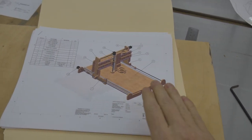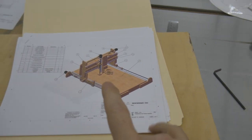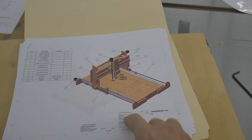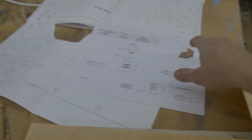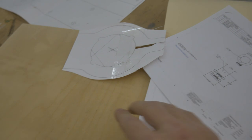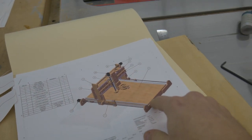Now, the key to any good DIY CNC build is a good set of plans. I got this set of plans from a guy named Dave Gatton — you can visit his website at DaveGatton.com. This is actually an older design of his, and he has an updated design that makes it easier to scale up the CNC. This design is two foot by four foot, and to make it four foot by four foot I'm going to have to modify some of the layouts. The great thing about Dave Gatton's designs is he provides full-size layouts you can tape together and cut out to use as patterns. And I'll be using Baltic birch plywood to create this CNC router.